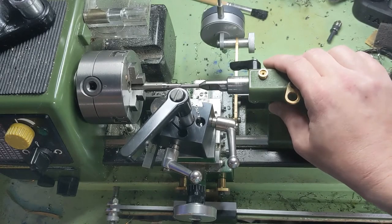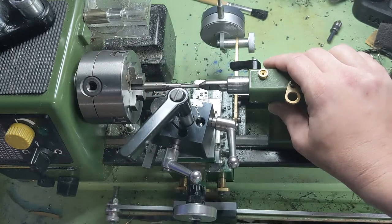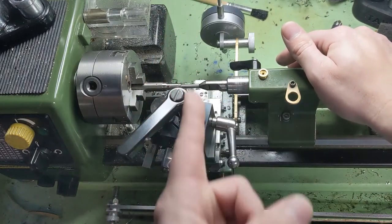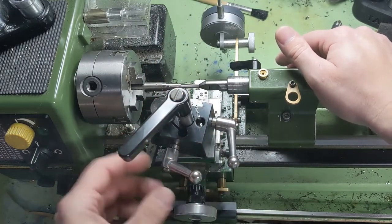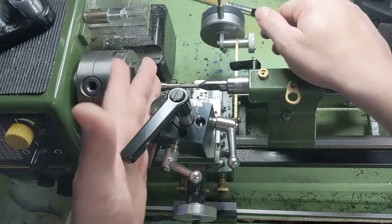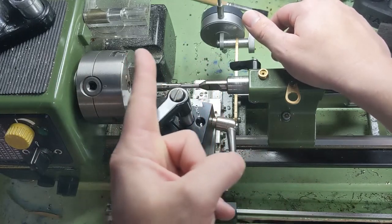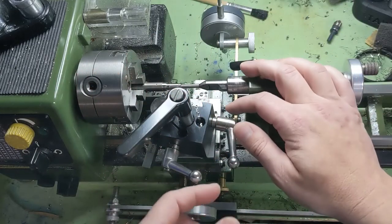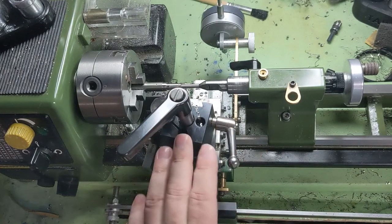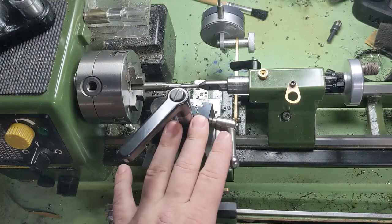A few things I wanted to get in the video but didn't talk about earlier. The first is radial loading, which is working perpendicular to the axis of rotation. If you're familiar with mini lathes, anything you do that's radially loaded is going to be difficult — that's always the case on these mini lathes. Facing operations, you're probably going to have to take light face passes — cut off of the hacksaw and then re-face the back face. If you do have to do some grooving or plunging, use a smaller tool and kind of zigzag your way in, clear things out, and then get in there with a tool that has better geometry once you've cleared things out. I have a habit of using carbide thread inserts to rough out undercuts and things like that.